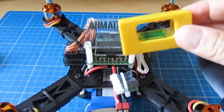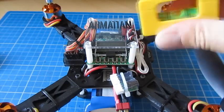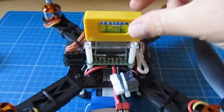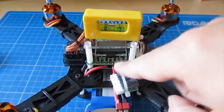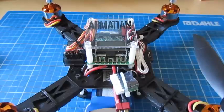The way I do this is using one of these little spirit levels — this one is designed for fly bars and is in one of my other videos. It's a nice small spirit level that lets me check the quad is absolutely flat both front to back and side to side. What you tend to have to do is shim the feet with bits of paper until it's absolutely spot on. Once it's spot on, go into that menu, hit continue. It'll reset — then recheck the display to make sure it reads zero, minus one, or one degree for both roll and pitch. That means the board has learned what level is and will use that as its reference when self-level is active.